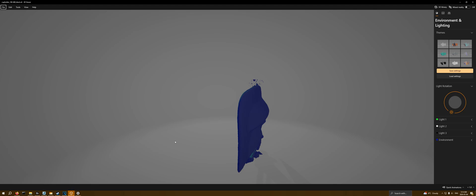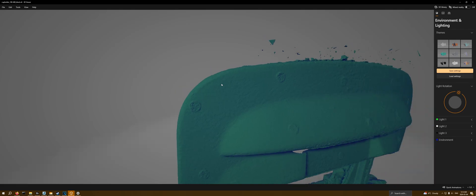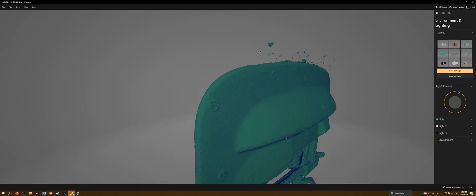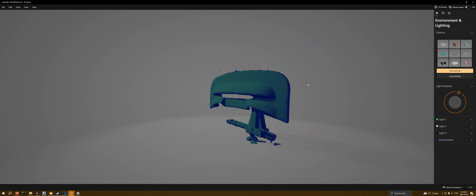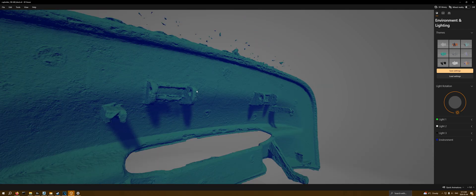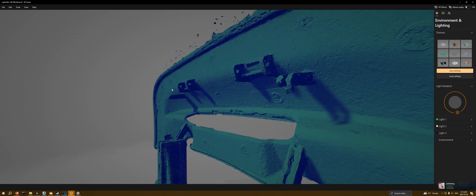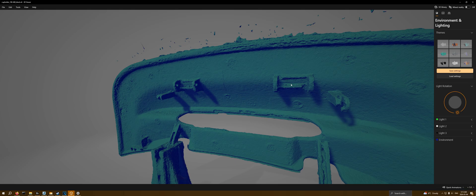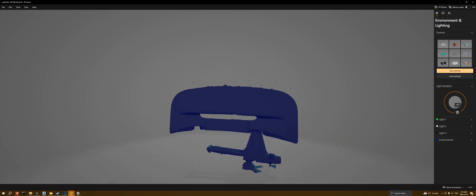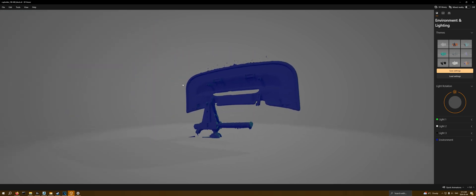Even looking at it as just the exported STL, you can see the surface is really rough. But the actual part itself does have a texture — it's a textured plastic — so that makes a lot more sense. It's not at a state I would consider usable to just toss on a resin printer. You would have to spend quite a lot of time in Meshmixer smoothing out the details, and you would also have to remodel all the mechanical functional parts, remove them from the scan, and replace them with precisely designed CAD versions. But this is not bad — this is the best result I had.